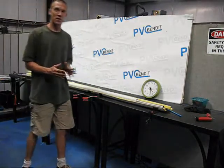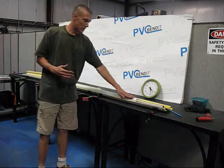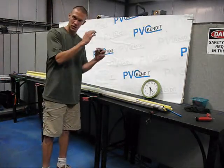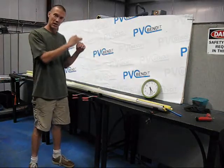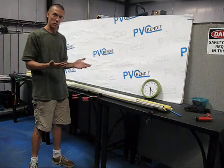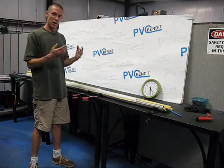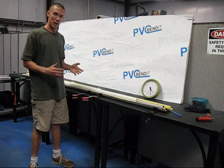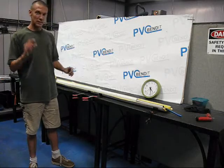Just like any other bend, you want to keep rotating the pipe while it's on the bender. Even though this brings it out and brings it a lot closer to the surface of the pipe, the bottom where the bender is actually resting is still making solid contact, and so naturally it's going to be warmer down there. So by rotating, you'll ensure very even heat through the pipe. So it looks like it's about ready, but we've still got a little bit longer to go.